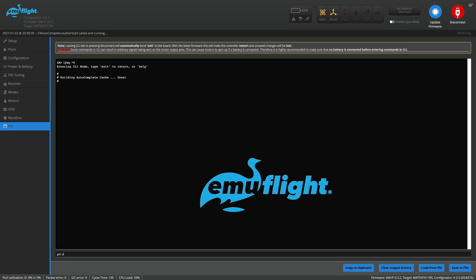Now that takes some getting used to but I really like it. You can adjust how much of a mix there is — you don't have to go all right stick or all left stick; you can play with that and find something that feels good to you. The CLI commands that matter are 'add yaw to roll' and 'add roll to yaw' and those names are super confusing. What it means is: add input from the yaw stick and turn it into roll, or add input from the roll stick and turn it into yaw. So if you want to do that right stick steering, turn up the 'add roll to yaw'.